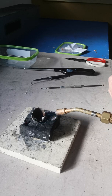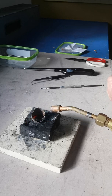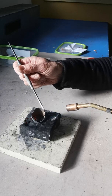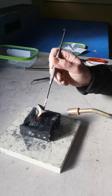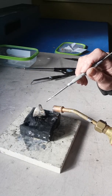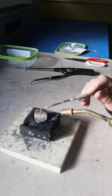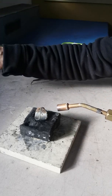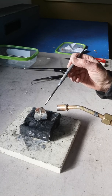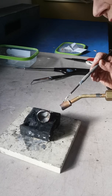Just playing the flame around. The metal's not a great colour anymore — it's not very shiny. But I can see where it's contacting and I can see the flux bubbling. I'm going to try to put the solder on — and the solder's melted straight away. I think it was the right temperature. Turning it over. The solder's gone somewhere I can't see, so I'm going to put another piece on. Joining it up at the top — and you can definitely see it melting in the join. I can see it on both sides, so I think it has joined.